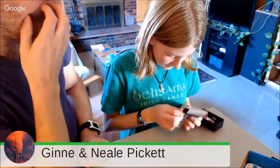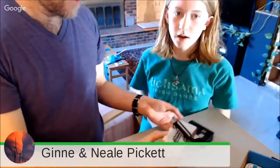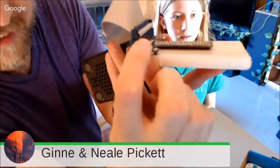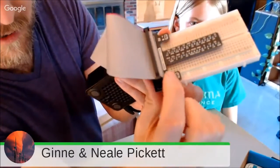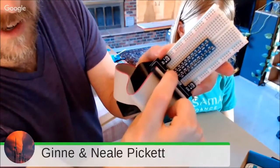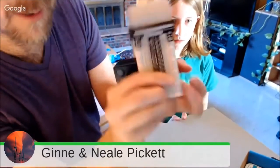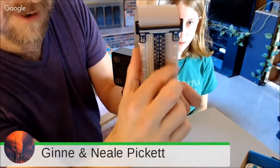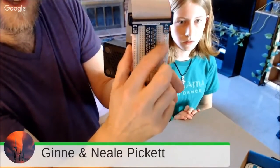This isn't something you're really going to have to take in and out a lot — just leave it like this. This pin needs to go in row one, and the top one on the other side goes in the second row of the power rails. What happens now is you have a three-volt and a five-volt power side. We're mostly going to be using the three-volt power side, but if you get some chips that want five volts you can put them over here.